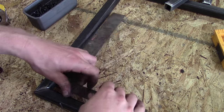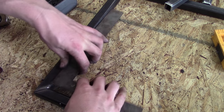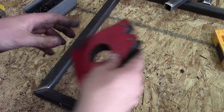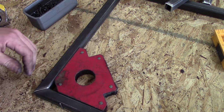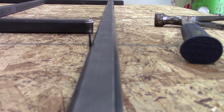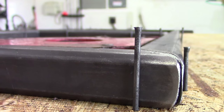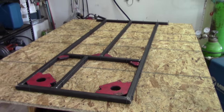Notice I used a square to keep everything perfectly at a 90 degree angle. There are also nails that I nailed into the plywood to secure the frame in place. I'm also using some welder's magnets, which aren't necessary but nice to have. Notice that the nails are not at the point where I'll be welding or where I need to have access through a square.